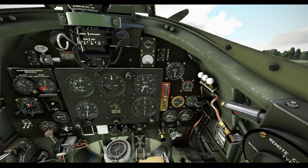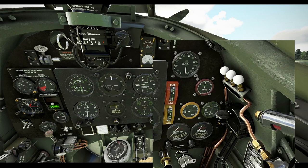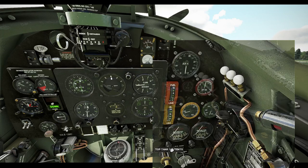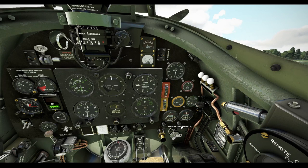Moving to the right side panel: at the top is the voltmeter for battery condition, and immediately below that the generator charging amps meter and switch. Coming down the right side we have the all-important engine management section of the panel. This consists of a tachometer, boost gauge, fuel and oil pressure gauges, oil and coolant temperature gauges, and at the base two fuel tank gauges with their indicator buttons. The fuel gauges are off at all times unless the buttons are pushed for a reading — this was to conserve power supply and wear on the delicate instruments. The fuel gauges have double scales to show the fuel level in normal level flight and when on the ground at an angle of rest.